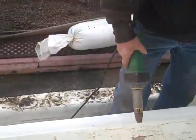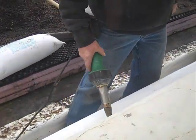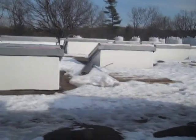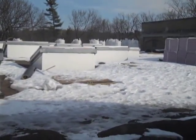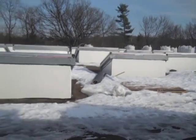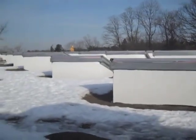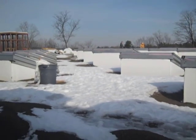Before the edge of the roof is finished, we can see all the layers that comprise the green roof — in particular, the three layers of extruded polystyrene rigid insulation placed above a protection layer over the roof membrane. When the snow falls, it's easy to see why the cast concrete skylight walls, covered with white membrane flashing, will also need to be insulated. The ring of melted snow around each unfinished skylight demonstrates the effect of heat loss through the as-yet uninsulated concrete walls.